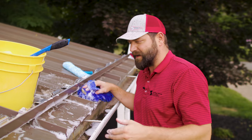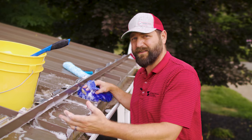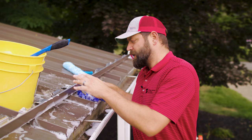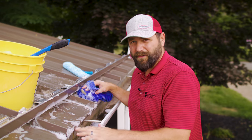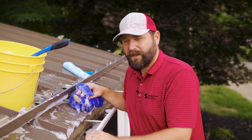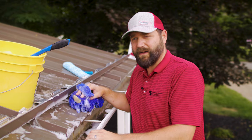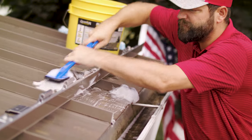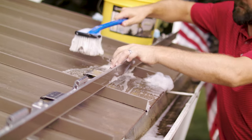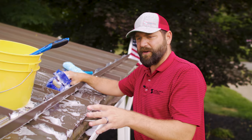When I'm wiping things off like pollen — pollen's not that intensive, but there are types of pollen that can cause issues, so you want to make sure you remove all types. You could have bird droppings, things that are high in ammonia that you want to wash off. If you do not take care of them over time, it'll eventually cause issues. This amount of scrubbing — about 30 seconds per panel — is not really necessary; I'm concentrating on the high areas of buildup and gunk.